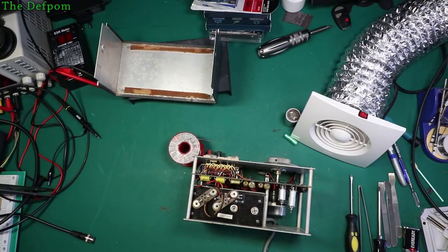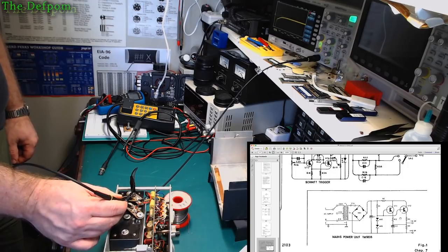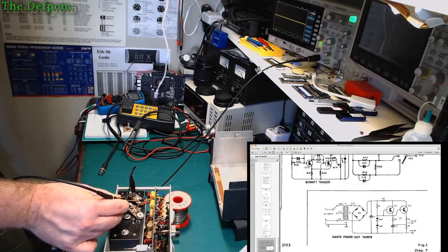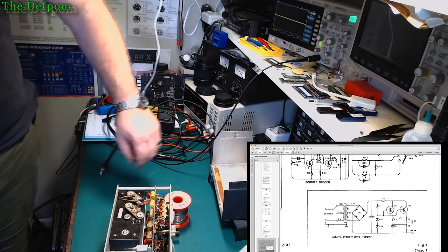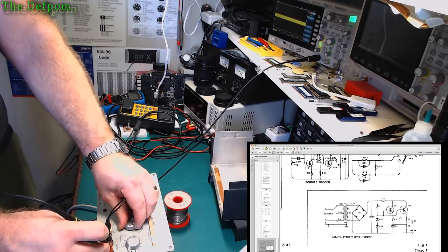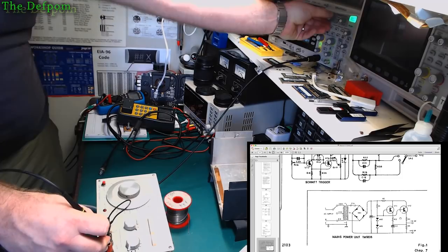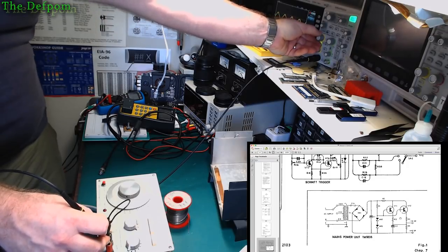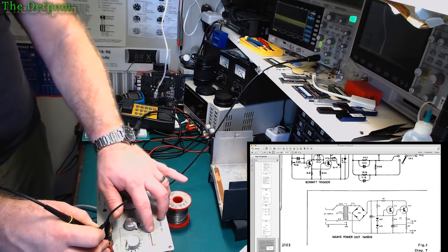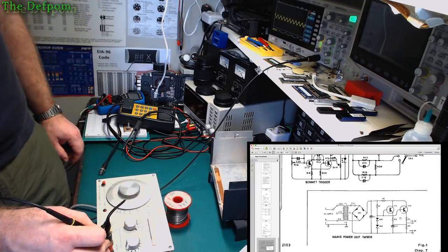Right, let's power this up and see if we get a better waveform out of it. Look at that - nothing there, all the ripple's gone - so there was definitely a problem. We fixed something. Let's hook up to the output and see what we get. That is looking a lot better. There's no DC offset. The output does look weak, but it's not noisy like it was before - we've definitely fixed that part of it.